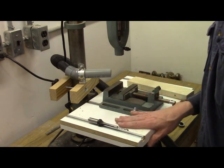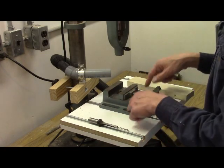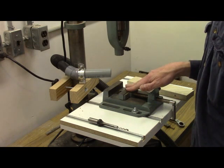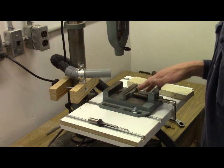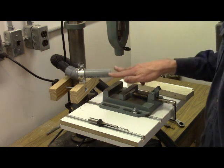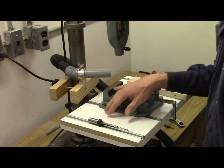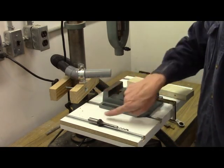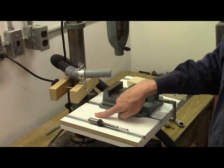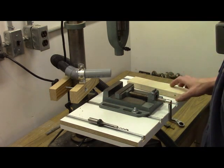The other add-on is a modest auxiliary table for the drill press, made of two pieces of melamine with T-track in it. The T-tracks are spaced to fit an inexpensive drill press vise — I paid $14.99 for it at Lowe's. This is far superior to the vise or hold-down clamping system that came with the mortising attachment. The hold-down foot worked well enough, but the fence and those little J-hooks that were supposed to hold the work to the fence were totally inadequate. This vise is quick-acting, clamps with more than enough force, and provides the repeatability you need to get a true mortise.